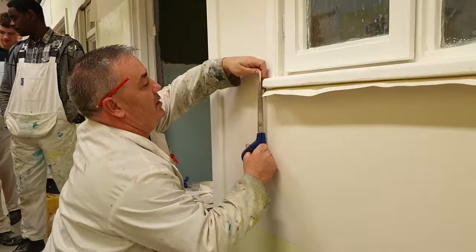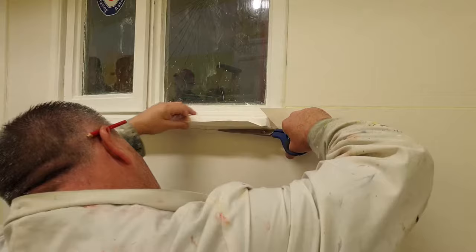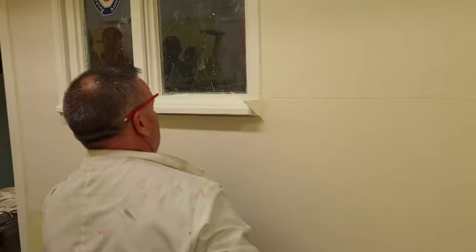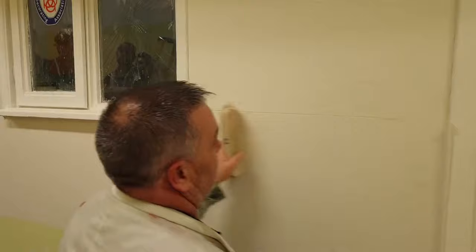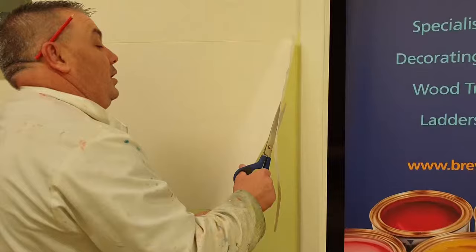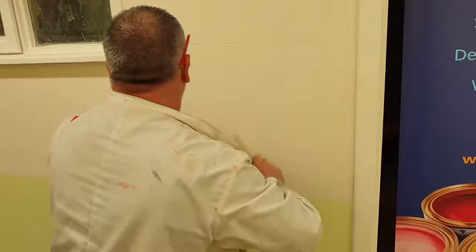Pull this paper back toward the wall — we are not dragging it fully off the wall. Put your paper up and press it into place. Then the last bit down here. It's a little bit off on this one because the paper was put on before and just ran out a little bit, making it more difficult to keep it running true. If you ensure that your first piece of paper is straight, then every piece of paper will run straight with it.